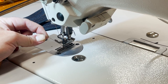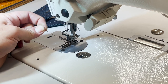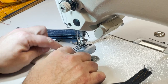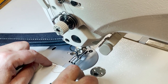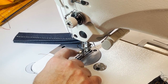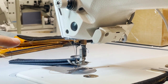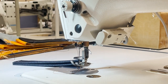The needle comes in and moves back with the feed dog. That's why they're called needle feed. A lot of people want needle feed — this is a sewing machine that a lot of people are looking for. The very heavy duty plate and heavy duty feed dog are different than the 8700 or any walking foot. The plate and foot have to be open toe — anything used on this machine has to be open toe, meaning when the needle comes down it goes back.